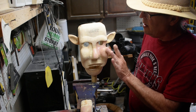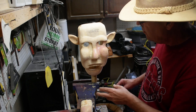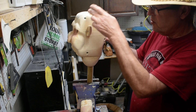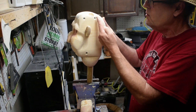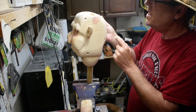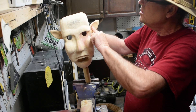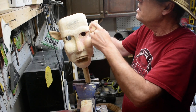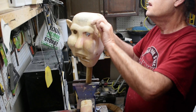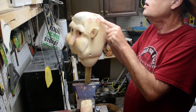We're going to go ahead and get this all covered and then let it sit. Where you have your holes up here for your drill, the reason why you inset them was so you can cover them up. Same thing with the ears — we inset those screws so we can put this putty in there and get them covered up. Normally this is where you need to put a second coat on these, because when they dry they do kind of sink in a little bit.